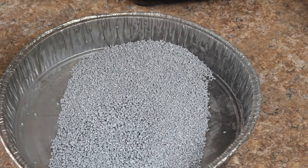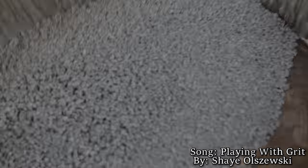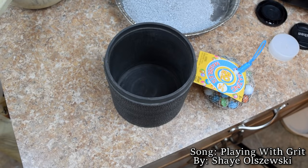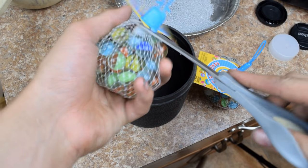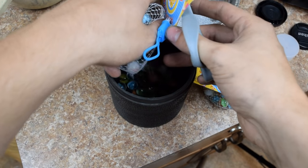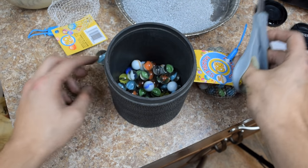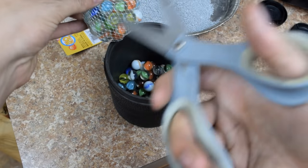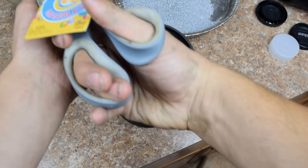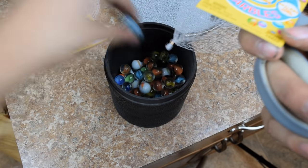This is what I will be working with. As you can see, the particles are a good size to start milling. So now that we have our aluminum sand, we are just going to add it to the grinding barrel of our mill, but we first need to add a grinding media to actually pulverize the aluminum into a powder. My best find so far has been standard glass marbles — they are cheap and they don't spark, so they shouldn't cause spontaneous combustion unlike iron or steel ball bearings, which might spark while milling and could ignite the aluminum powder.